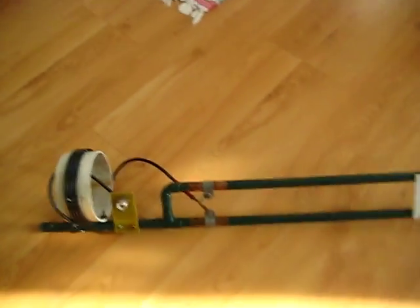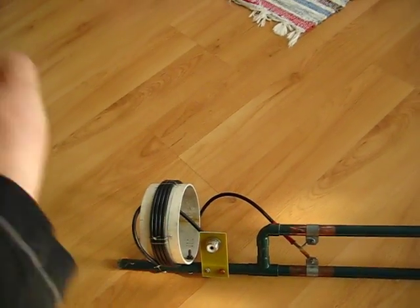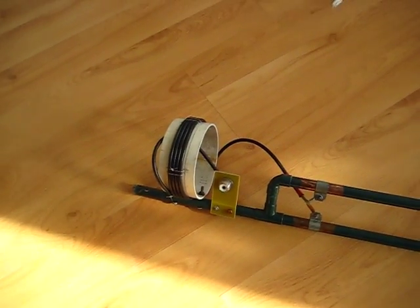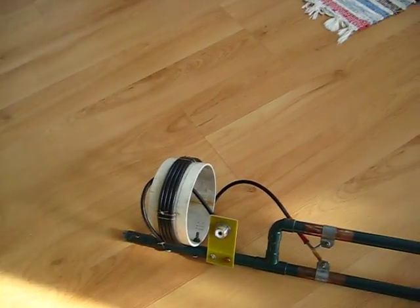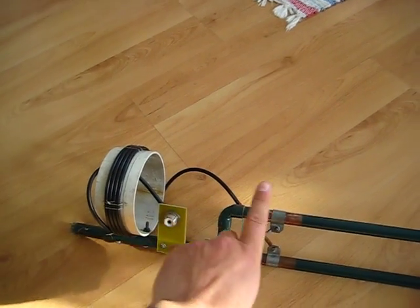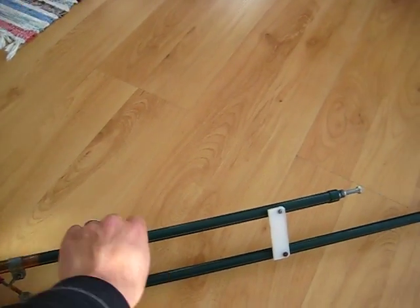So let's start with the base here. There I have the choke balun, which is a must — it's an essential part of this antenna because it stops the copper braid in the wire from radiating. And here is the connector, the two tuning slides, and here is the tuning stub.